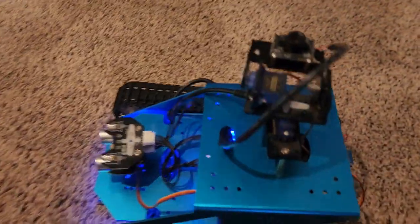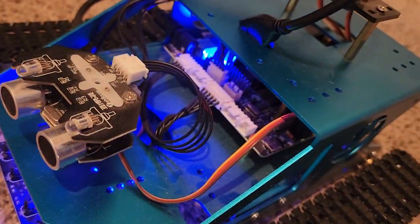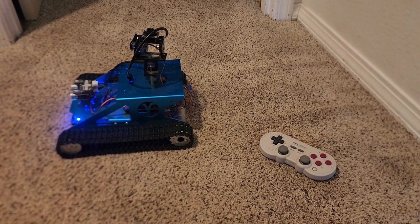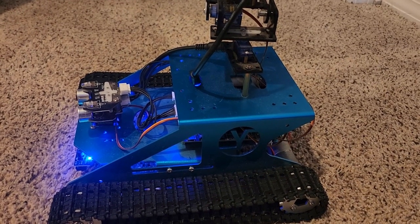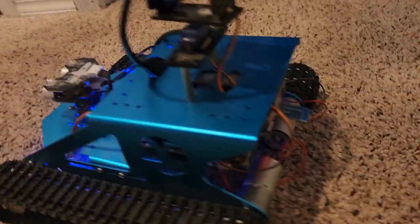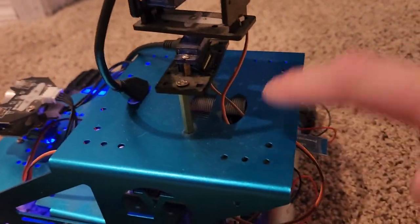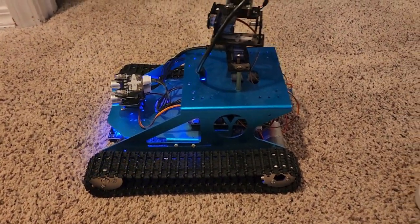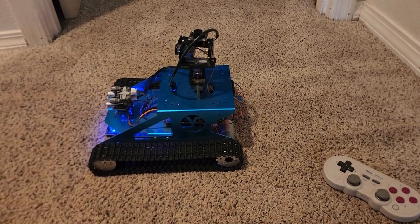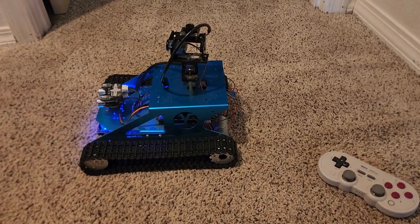So I'm gonna go over to my tank now. I've just got the plain Yahboom G1 tank and all I've done is put the Raspberry Pi onto it. All I've really modified is the software — it's a stock Yahboom G1 tank. You have to buy either with it or third-party a Raspberry Pi; I've chosen a Raspberry Pi 4, connected with a ribbon connector. I have Ubuntu 22 running on the Raspberry Pi 4 and ROS2 Humble running on that, with the three nodes doing different things like I showed at the beginning.